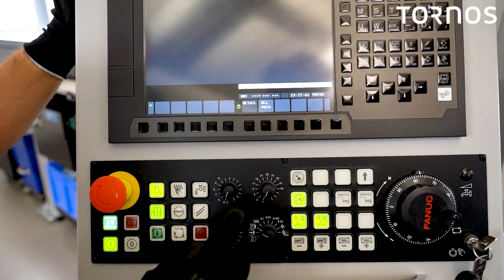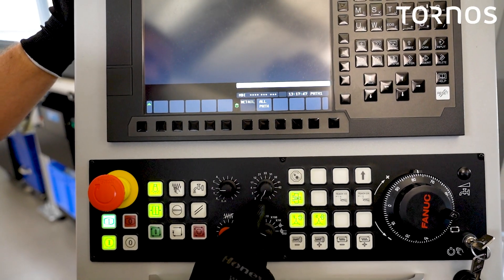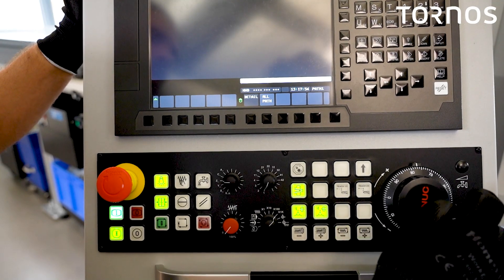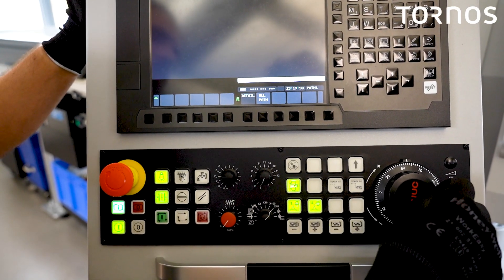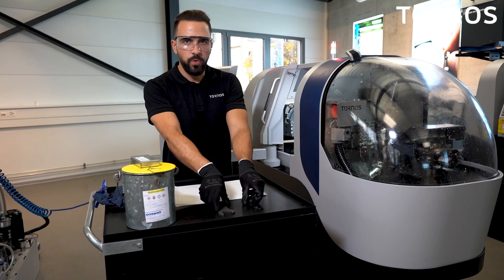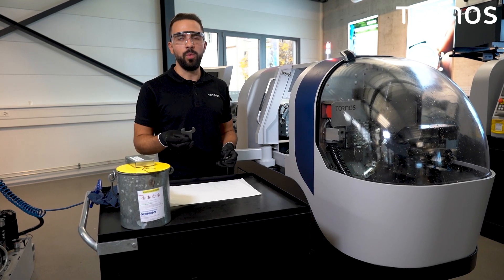Select Z1 axis. Move to Z. Select 1 and move to the function Handle. Then you are able to move the spindle in the plus direction to the software limit. First step: loosen the nuts of the spindle with the dedicated tools received with the machine.